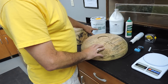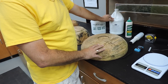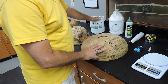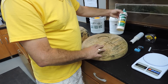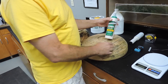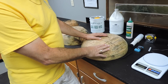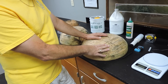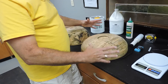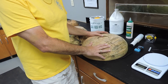Now the Anchor Seal I have not used yet. I don't know why, but the Packard's sealer just seems to be doing a good job — and this was like $16 or $17, while the Anchor Seal was like $35. I am going to try it because I'm not going to let it go to waste. One of the other bowls — the very first one I did — I used wood glue on the outside, left the inside untreated, wrapped it around the outside, and packed it in shavings. I don't have that bowl out here because when I pulled it out to check it, it's still at 32% humidity. So it's got a long way to go to dry; I repacked it and put it back up. It's also a large bowl, but it's drying a lot slower, which I guess is a good thing.